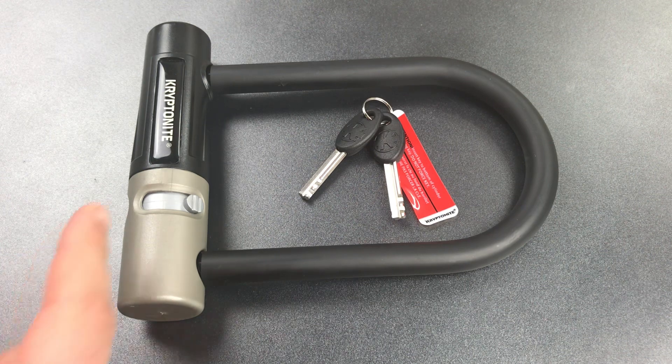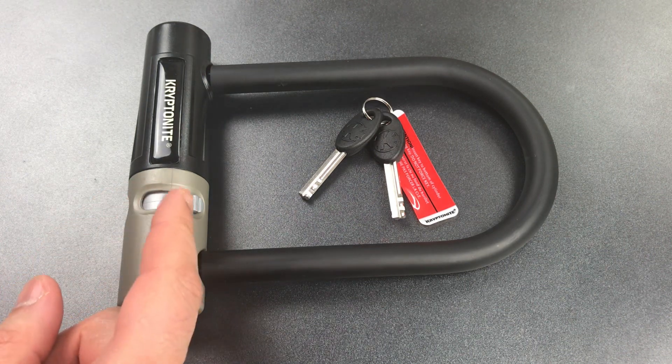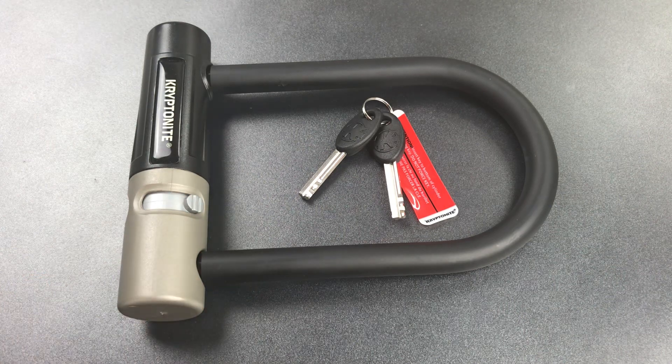Most of these locks either tension from a front or back disc, often times both. The reason for this is by putting zero-cut discs in the front and back positions, the maker can ensure that the sidebar doesn't become angled to the axis of the lock and jam the core. This is particularly important on the cheaper locks, which have discs that may not be perfectly smooth on the edges.